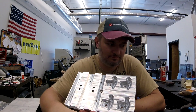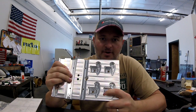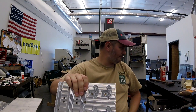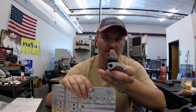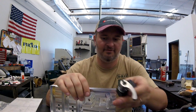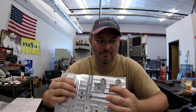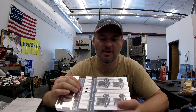On this side we're looking at the handle side. We're going to use machinable pit bull clamps because the handle registers — that shape is going to register in here and hold it aligned perfectly. So I just need something that's going to provide force holding it both into that pocket and down — I don't want it pulling out of the fixture. Many thanks to those of you on Instagram who chimed in on what to do for that one, because that part was really causing me some concern.